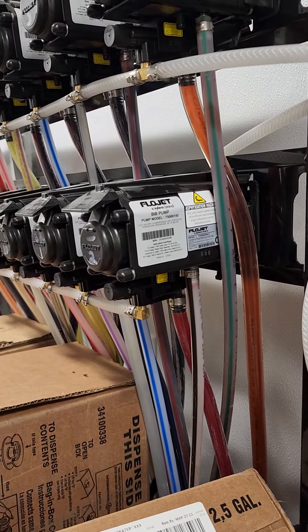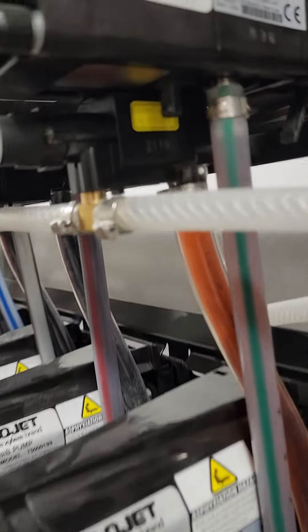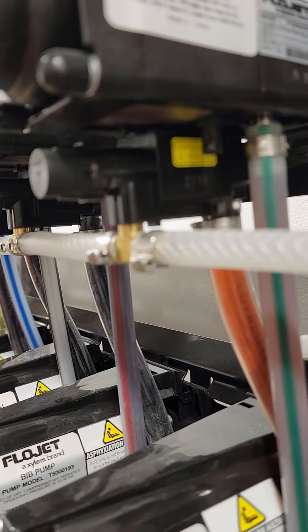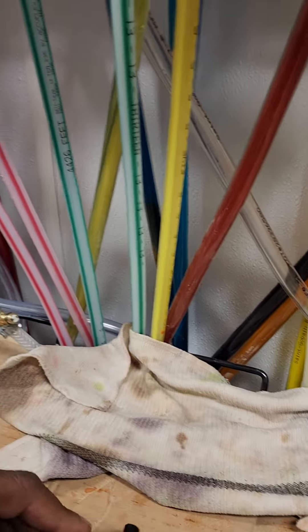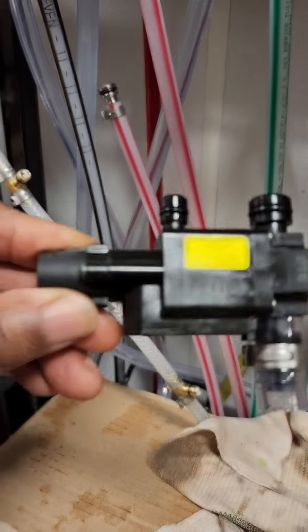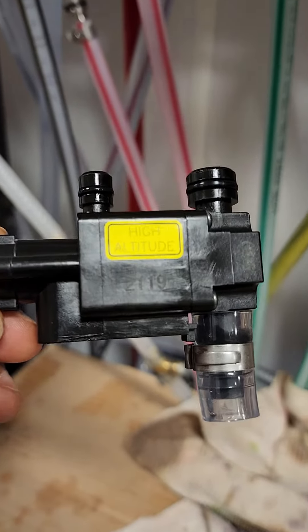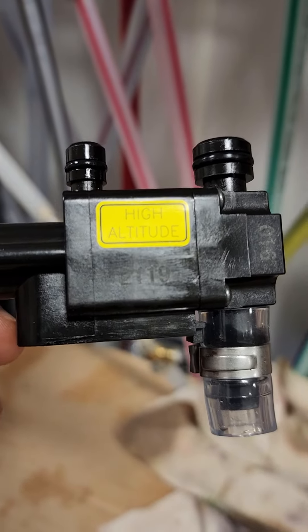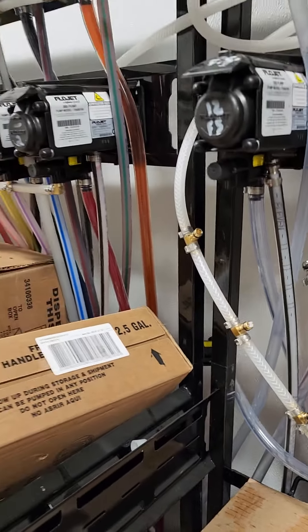The reason none of these are working — do you see this valve right here with the yellow tag on it? That's an auto shut-off. I'll show you one I've already disconnected. It says 'high altitude' on it. These auto shut-offs can only be used in high altitude areas of the country.